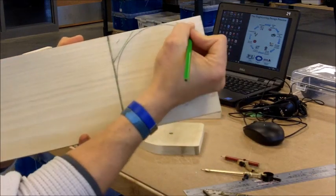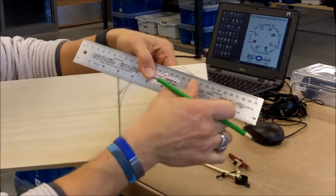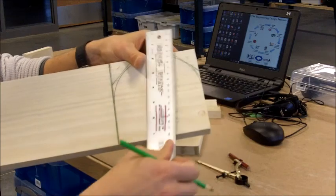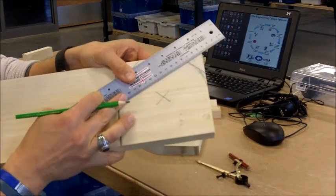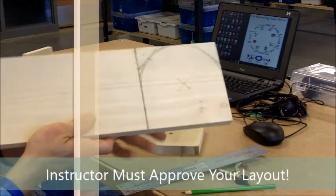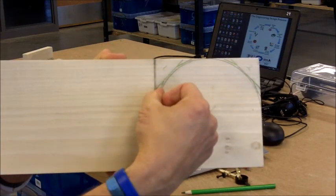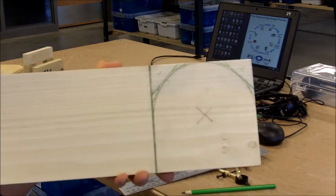You'll have one piece getting cut out on each side. Since these are still a little big to sand, come back with the ruler and draw another straight line just a little above the curve line — an additional cut after you remove the main piece. You will not be allowed to go cut on the bandsaw until your instructor sees that you have everything marked correctly. You have a little roadway, straight roads that get cut — first this section, then these little triangles — keeping your fingers safe and minimizing sanding time.